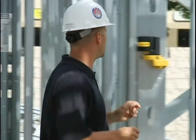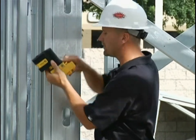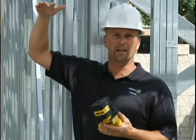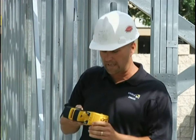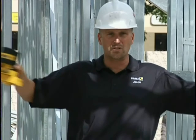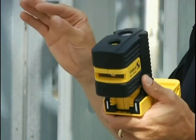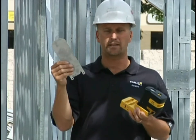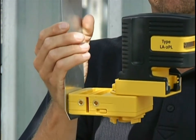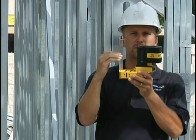Later on this job site, after they run all the HVAC, they'll drop a ceiling in to cover it. This laser with its 150-degree fan angle and solid horizontal line is the latest way to do grid ceiling work fast. With a rotating laser you're waiting for a dot to spin around, but on a job site 50 feet and less, a horizontal line is fastest. This laser comes with a metal plate that slides behind the first piece of wall angle you put up — connect the laser, line it up two inches below the grid, and build your ceiling.